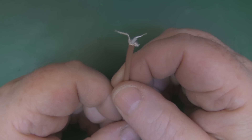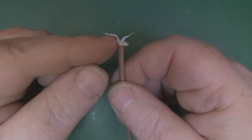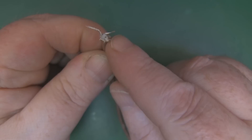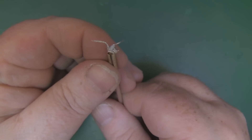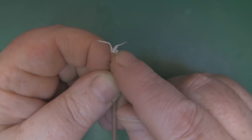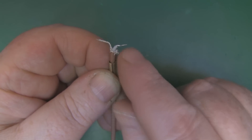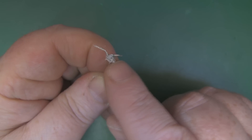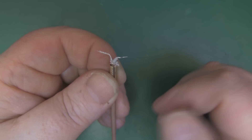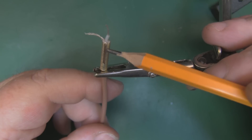You need to prepare your coax as I have here. I've cut away a large amount of the outer braid, leaving a few strands to make a connection for the element when soldered in place, and a small amount to solder directly onto the balun. I've got the centre signal wire exposed with a little bit of dielectric left on as isolation so we don't short onto the outer braid, and that's going to be bent into a T-shape so we can solder the elements directly onto it.